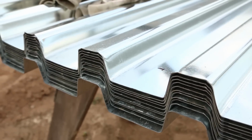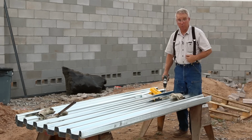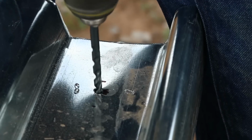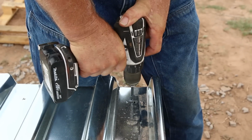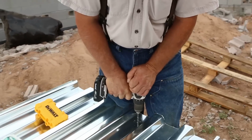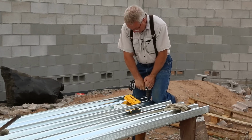So this idea of gang cutting or gang drilling is most often used in my world with lumber. You can see a good example of this in the SkillSaw Pro Tips video that we posted way back when. But it's a method that I bring often. Almost in every project there will be an opportunity to stack work up, lay things out side by side, and perform the same operation through multiple pieces at the same time. It's a force multiplier. It'll make you a better hand.